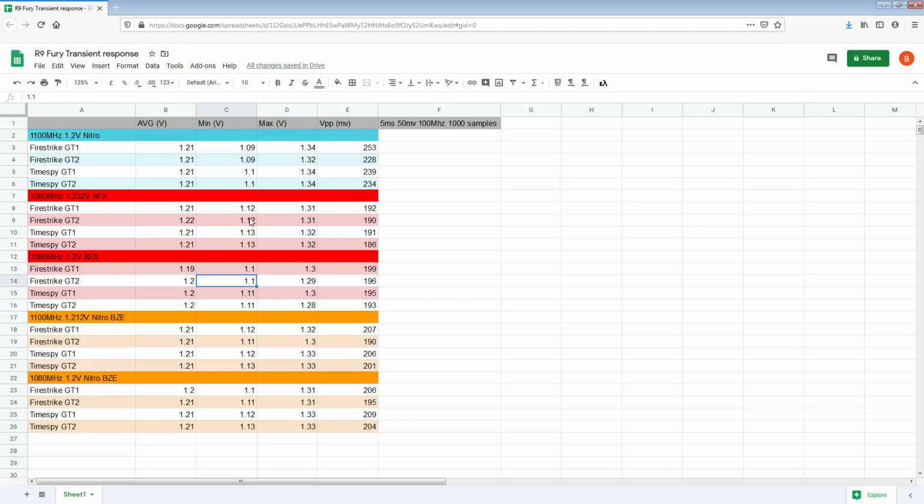And then if we look at other tests, it is consistently getting 10 millivolts better results than the Nitro Fury across a variety of workloads. So it basically looks like the reference PCB is just better than the Nitro PCB, and when we look at it, it'll make sense why. After doing this first round of testing, I was like, okay, I find that very disappointing. I will not accept having the card with the nicer heatsink and the custom PCB having worse voltage regulation performance. So I went ahead and did a Buildzoid edition, where it's just like fix the problems, right?